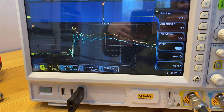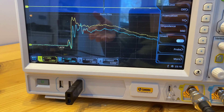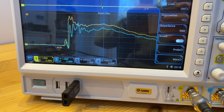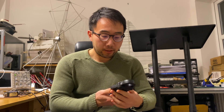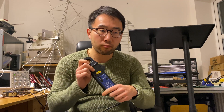In terms of fast rising edge signals, we tend to trust the much wider bandwidth probe more — in this case channel 1 rather than channel 2. From the second and third experiments, when we apply a fast rise high voltage pulse, we notice that this DC to 100 kHz current probe shows some current waveform which has a big resonance in it.